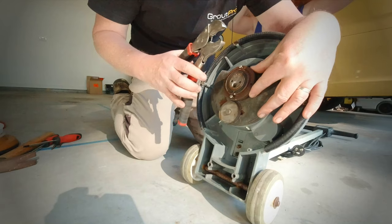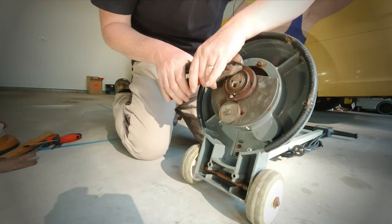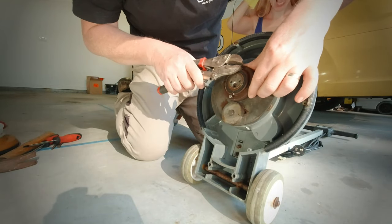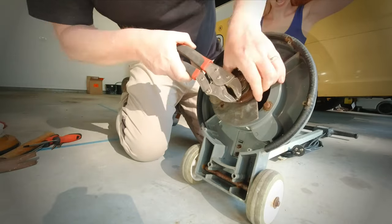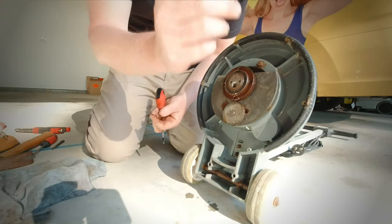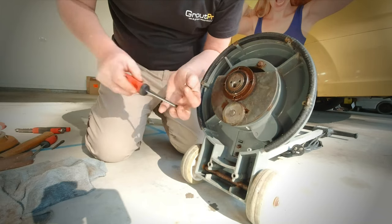Once you start getting them moving and unlocked, you can typically put a screwdriver back on and remove them the rest of the way. You adjust the grips so they put a reasonable amount of pressure, but not too much that it will crush the head of the screw. Lock it on and then gently twist until you get it releasing itself out of the threads. Then you want to clean up your screws or bolts, make sure the thread's all nice and clean, and wind them in and out to clean up the thread on what you're screwing or bolting into.